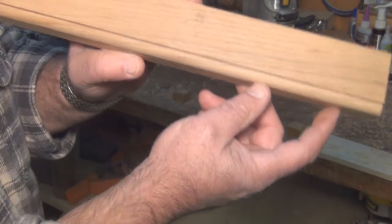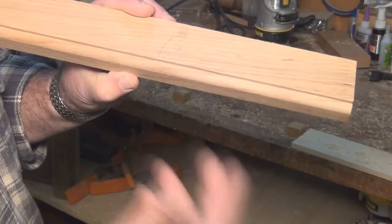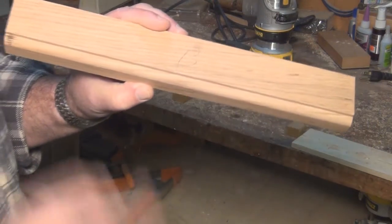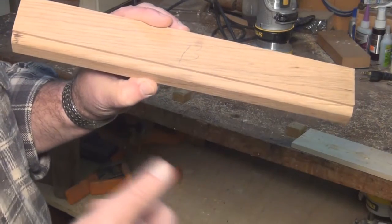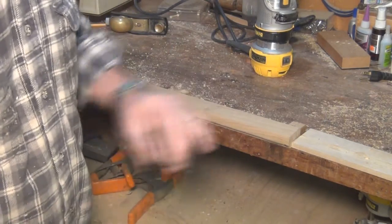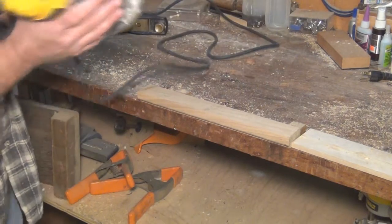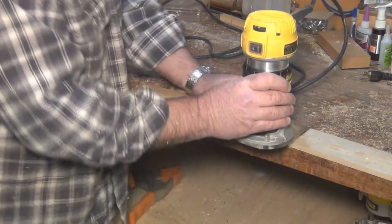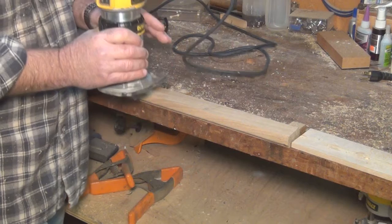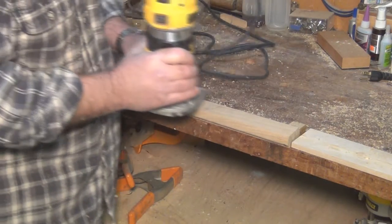Well, I failed to fail — I got a nice clean cut and it didn't chip out on me. It's just a testament to how sharp my bit is and the consistency of this particular material. But you will run into materials with a wild grain where you need to avoid chipping out. In that case you want to do what's called a climb cut — this is for experienced people only, and you have to be very careful. I'm going to be going backwards with this bit, drawing very carefully backwards. It's going to want to take off on me, so I'll make smaller cuts. I'll do a climb cut backwards and then finish out going forward.